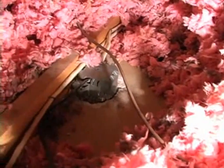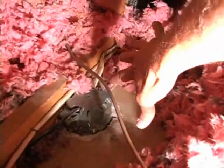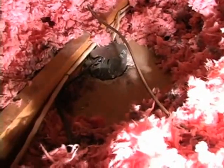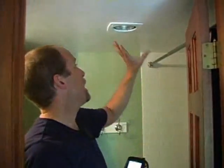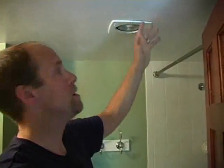Here's that smoke detector that we saw in the ceiling below. The detector was installed and the insulation was pushed away and never replaced. Similar to water leaks around penetrations through a roof, there are air leaks typically around penetrations through the insulation barrier.